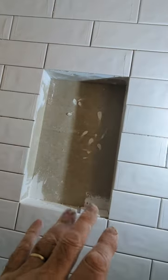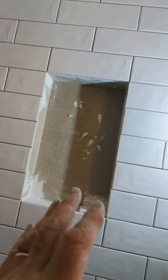If you try and make it exact size and you're off by an eighth of an inch, that becomes a problem. But if you make it slightly bigger — like an eighth of an inch bigger — then it just makes it easier for your layout to work. So when you're making your custom niches, make them just a little bit bigger so that you can fit your tile without a problem.